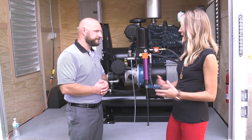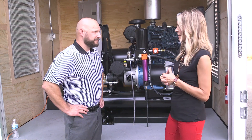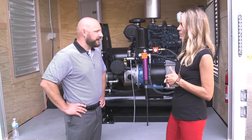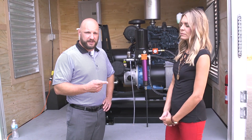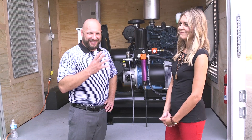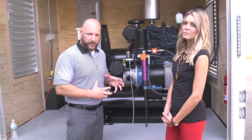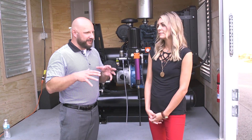If you didn't have an air dryer on your rig, you'd have problems in the future — this chemical likes moisture, so you'd have a lot of issues with your pumps, guns, and everything that has isocyanate in it. Problems can include moist or wet air into your drum mixer, which has an air motor that can cause issues, your transfer pumps, your gun, your substrate, your yield, and breathing air quality. What we're trying to do is prevent all those problems. Problems are downtime, and downtime is money.